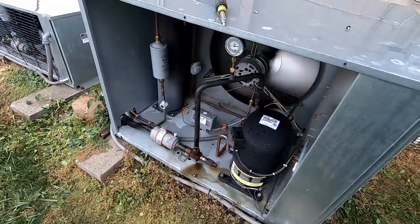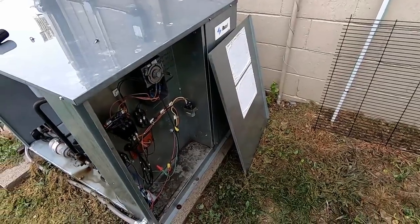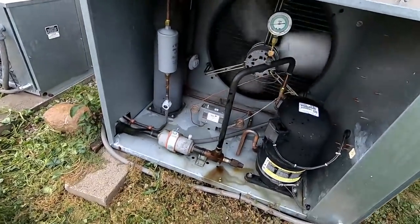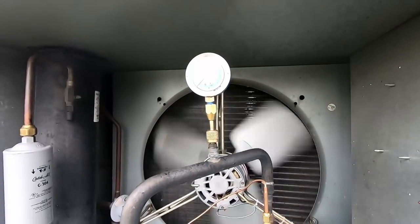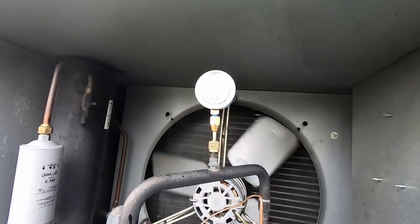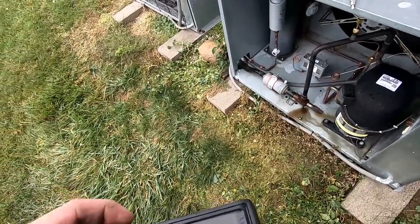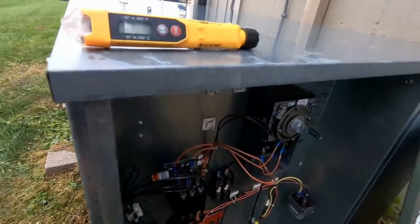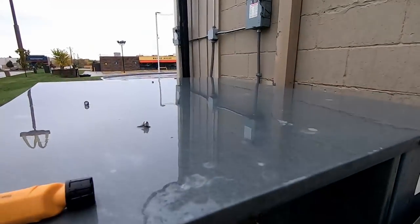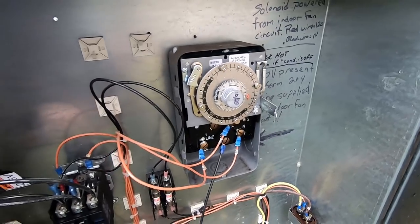I just don't believe the dirty coil was the only real reason why that thing froze up. There's really not a whole lot else that would have caused it other than maybe a TXV that's starving the coil, but not to the point where it's at. There we go — that's about two to three pounds, happy with that, it seems to be holding. So even though I tested it, I didn't get a very good connection. I found out this wire is live all the time even when the outside unit's off. Clock turns so much easier now and everything's working a lot better.